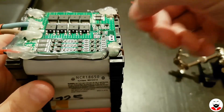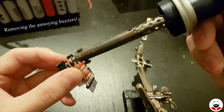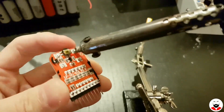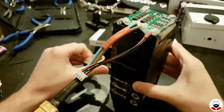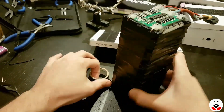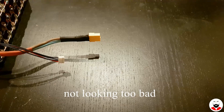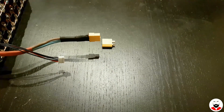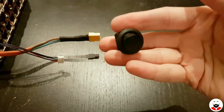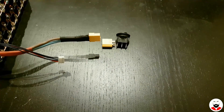I've called my friend hot glue to help me keep the wires in place. This is how the circuit will look: firstly we need a female XT60 to connect to the battery, then a switch — this one has an LED as well, and the gold contact which has to be connected to a negative.